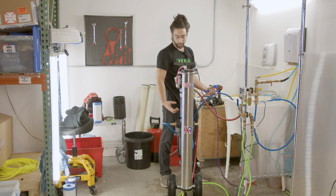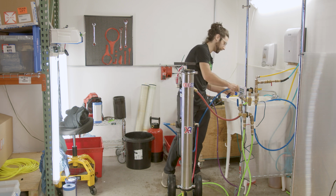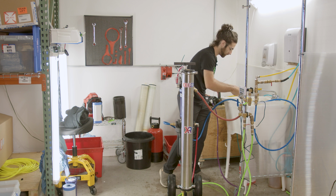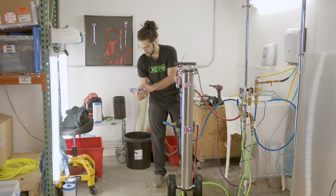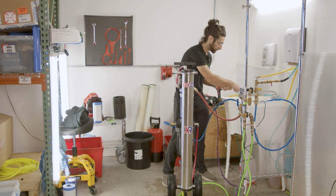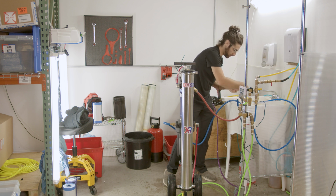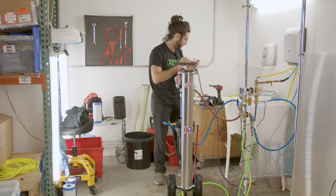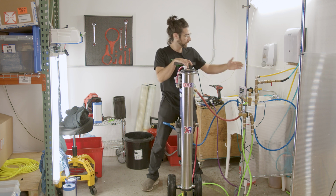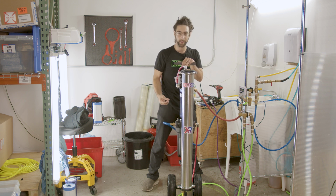Let's measure the quality of the pure water coming out of the system now that it has passed through carbon filter, RO membrane, and a 10-inch resin chamber. It's brought it down to 1 ppm. It's appropriate for cleaning windows. And I've received the same result on both meters. Now for theory's sake, we have 81 source, 81 ppm out of the source. And for some reason, this system is giving me 50 TDS.